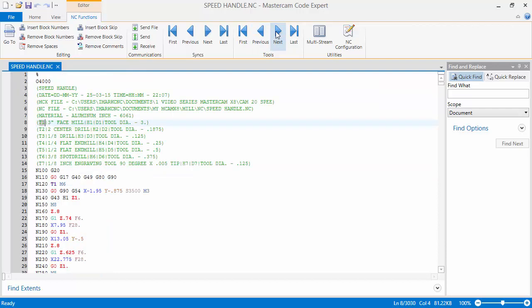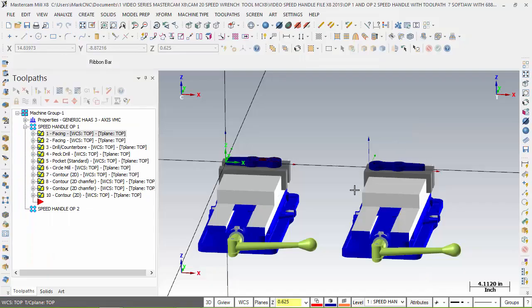So you can see as we go in here, it's going to use just G54 for the whole thing because I drew it in 3D space and I set up my environment in my CAD system. Digital manufacturing is the way to go. If you can relate your envelope of your CNC machine, you're going to have what I call a complete understanding of the relationship between CAD and CAM and never crash into tools. Hopefully. I still do. I think we all do. And that's what's fun about it.